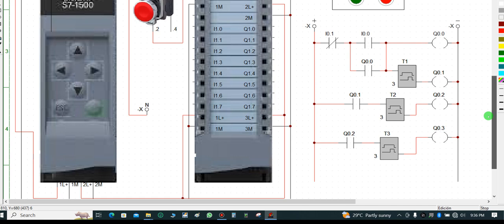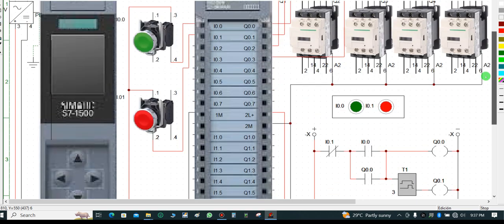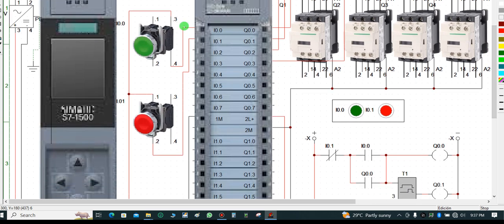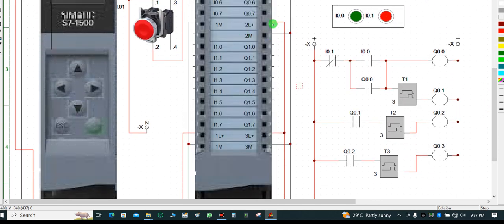This particular series of PLC has a two-compartment I/O module. One compartment contains 8-bit input from I0.0 to I0.7, and the other side is the output card. So this side forms one set and the other side forms another set.